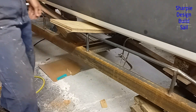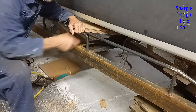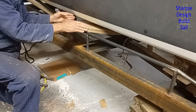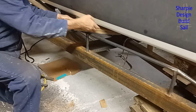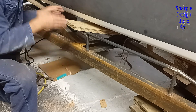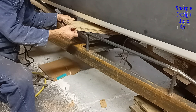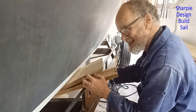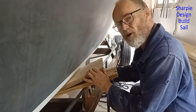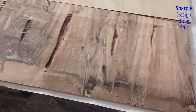It'll look something like that, but the trouble is getting it into place — you can hear it creaking and groaning a bit. This material is extremely tough. The whole thing with this area is it's extra wide because it's a conical shape underneath the hull. I'll be trimming a bit off the middle and a bit off one side of the ends to get something parallel that goes under the hull but fits it. It's got some real flex in it even after machining from 12 millimeters to eight. I just hope they aren't close to breaking — I'll give it some layers of double bias when I finish it.